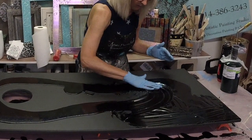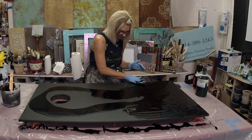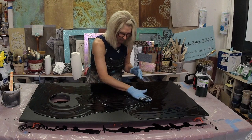You just want to move it out across the surface so that we have coverage everywhere. I've mixed up three ounces per square foot of product to cover this. This was a two by four, so that's eight square feet, times three — 24 ounces. I'm going to put it all across the top first and then come back and worry about the edges.